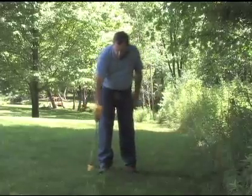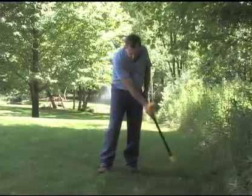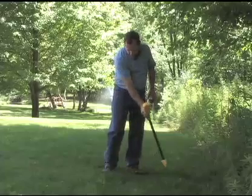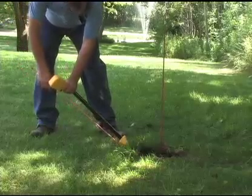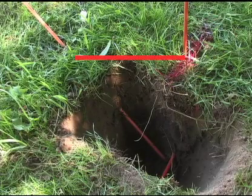Finding depth with the Pro 871C is easy — we use the triangulation method. The first thing is to find the path of the cable, preferably with the null method, as that's the most accurate way to find the exact location. Once found, mark it using marking paint or another preferred method. The horizontal leg of a right-angle triangle equals the vertical leg. So if we can figure out the distance of the horizontal leg, it tells us how deep the cable is. When the wand is at a 45-degree angle and pointed directly at the underground cable, you'll get the null signal again. The distance that the tip of the wand is from the spot where you marked the cable path is the approximate depth of the cable.